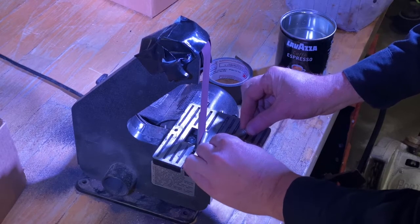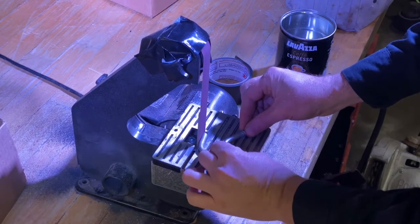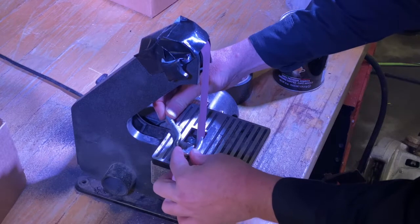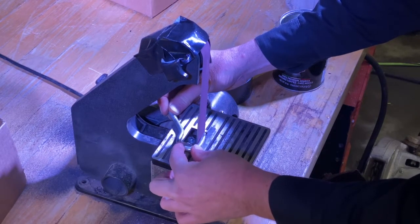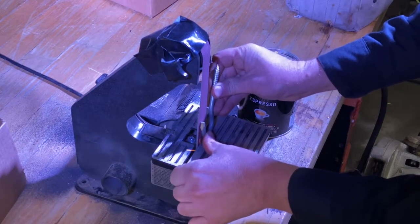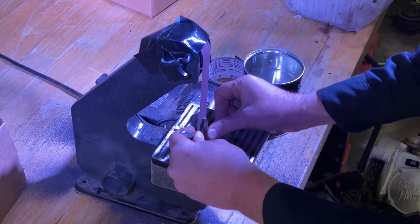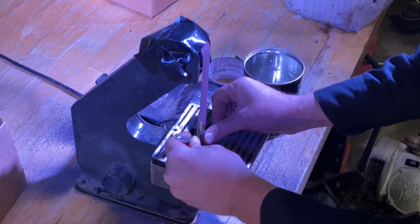Now here is an important part of the hook, grinding the tip here on the hook. And this is so you can get it under the strap. There are certain times on the tabla drums when you want that to be to a nice point there, and you can slip that under the strap real easily. And so this is a little process here of grinding little facets on the hook and just making it real nice, real neat, professional look there. A little polishing work.